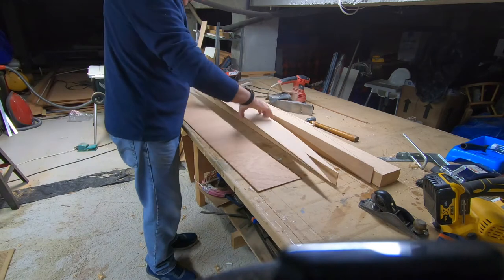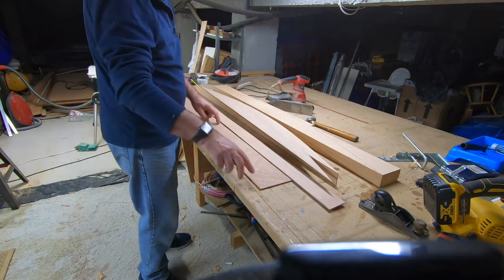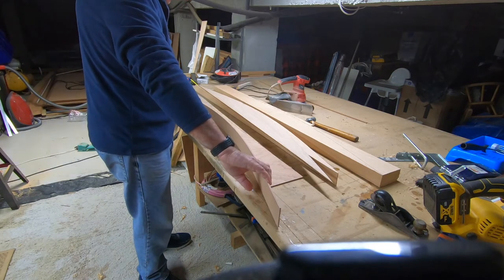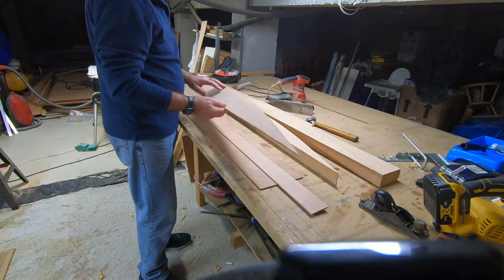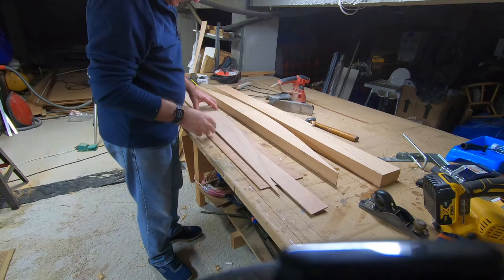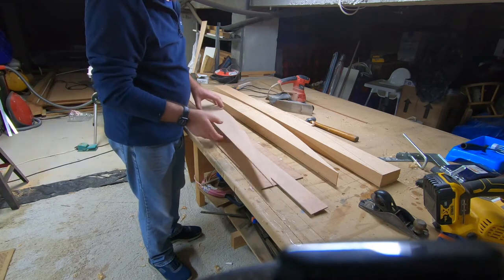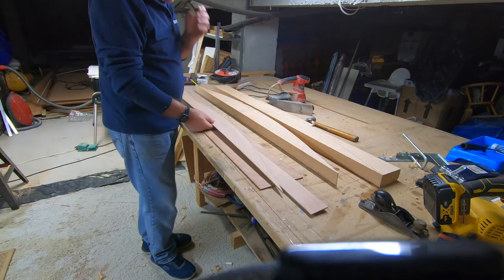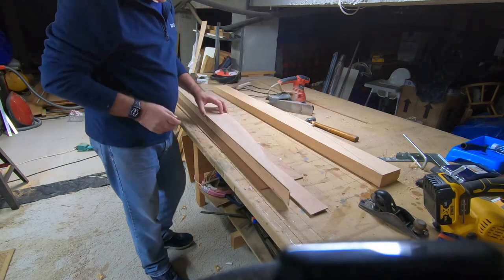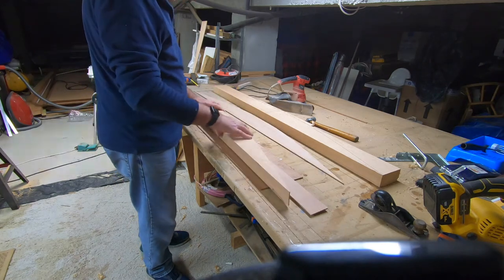I had to scratch my head to figure out how to make a fair curve. What I did was put a center line, knowing it's four and a quarter inches — 108mm — put a nail in there, put my piece of plywood across, and there was a fair curve. I drew that on the plywood and cut it out. I found that if you take a bit more time with the bandsaw and split the line carefully, you end up with a great curve that requires minimal sanding.